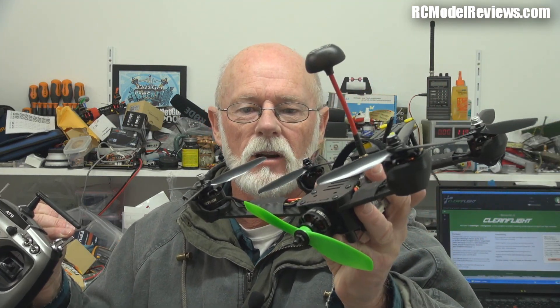First of all, I'll show you in parts of the video coming up, but I had problems with the motors — one motor in particular — which is probably a manufacturing flaw, but I'm not sure. The other thing was with this transmitter, which is really out of spec. I've managed to overcome the problems. I sorted out the motor shaft and I've just added some dead band to the yaw because the rudder stick just does not centre reliably. Physically it centres, but electronically it just doesn't go back to the same numbers — it's wildly out, which meant when I did a quick hover it was just constantly turning left.